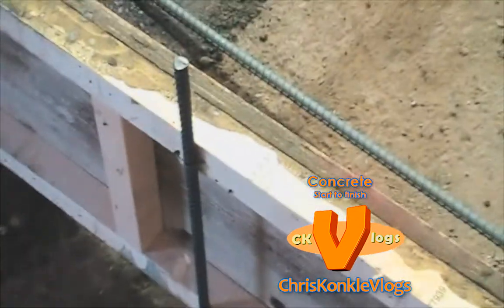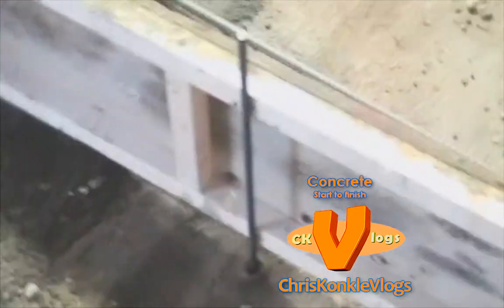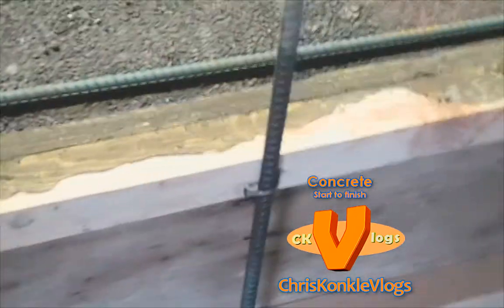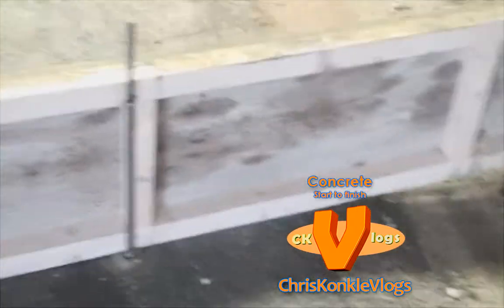This is a closer look at the concrete. You can see we have the 10M rebar here. We cut it at 20-inch lengths. We drill in 3 to 4 inches — make sure something hard is stable. You go a foot in, a foot in, and one in the middle. So you get 3 per form. These are 8-foot forms.